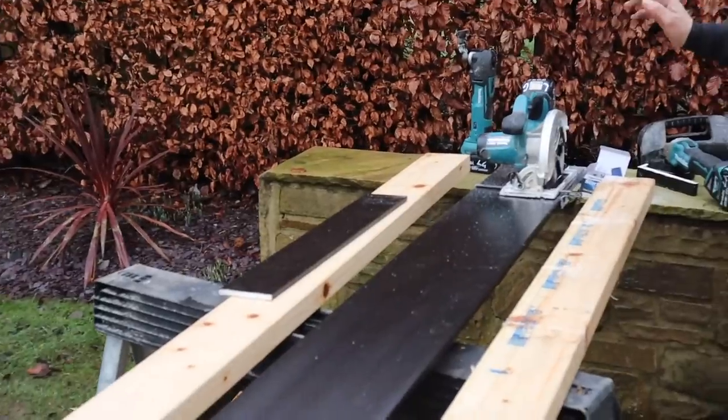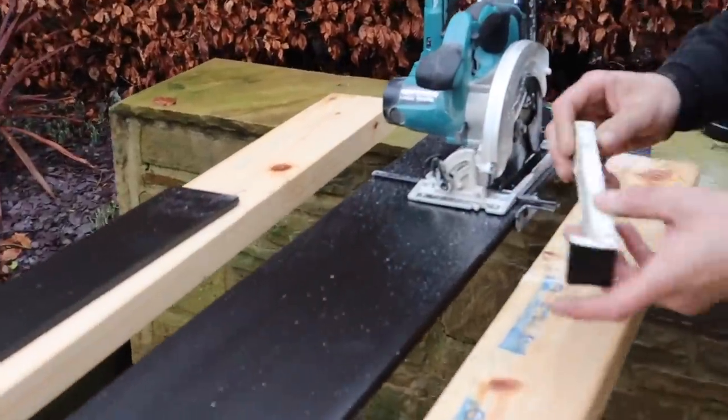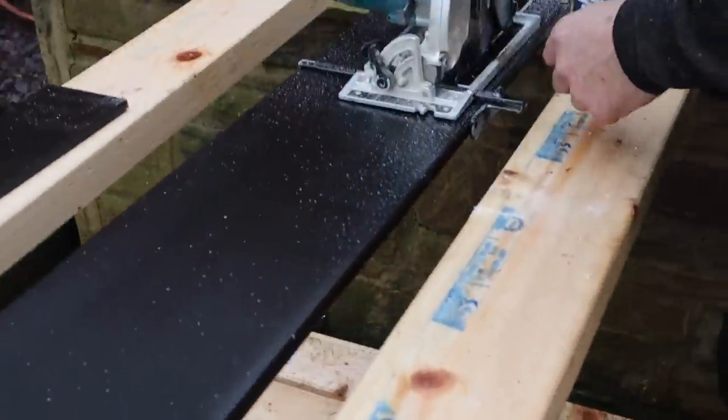It was about one or two degrees last night — we protected the rubber with insulation and you can see it's bonded to the OSB, still tacking off but bonded sufficiently. We've determined the height of our fascia, held it up and marked it, and we've set this Makita circular saw to cut it down.